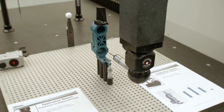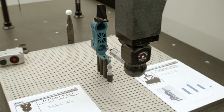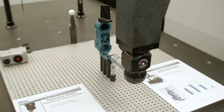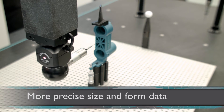This CMM with this probe head is able to scan the part. Imagine it's measuring one of these circles — it can put the stylus on the material and take the form of that circle, taking up to thousands of points. With a touch trigger probe, you take maybe four points to describe a circle, but with scanning you get a more precise size of the hole, plus form data as well.